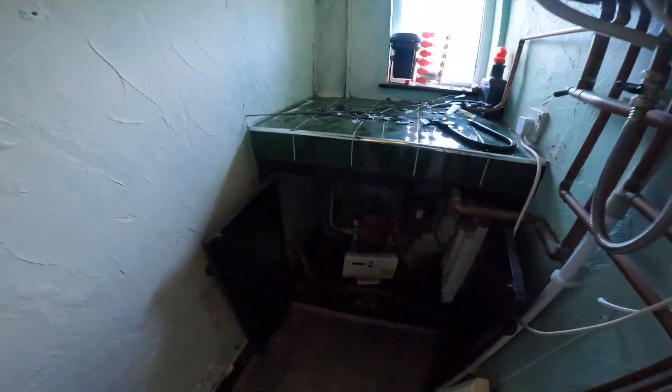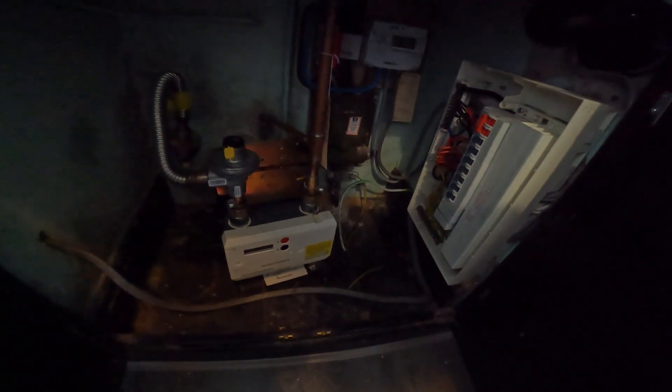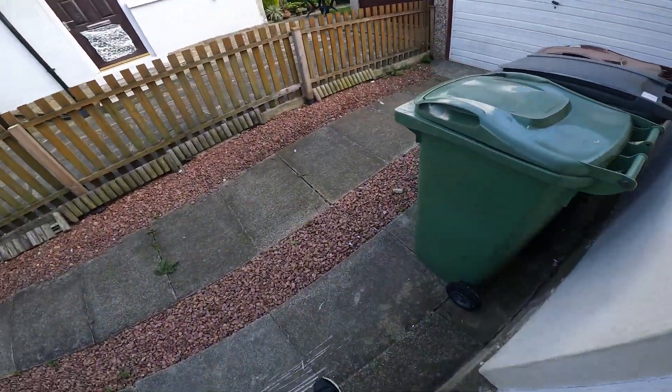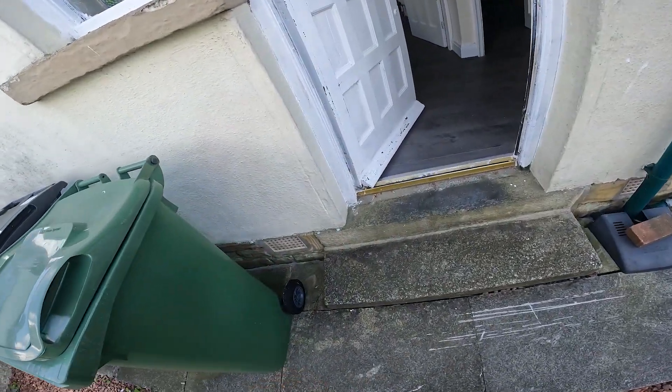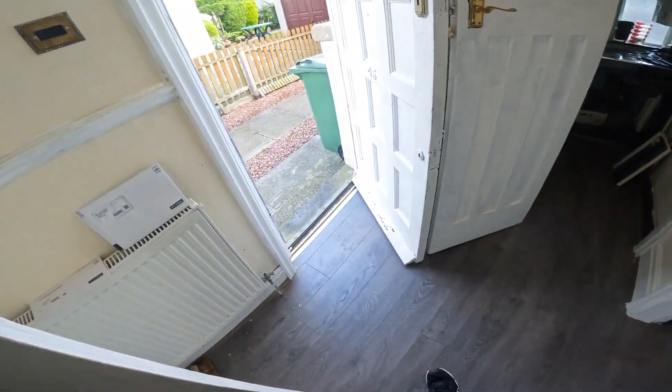Let's talk about the main earth then. That tiny little braiding - they've attached it with a tiny piece of cable. That'll need properly crimping off and lugging on, getting onto that screw down there. It needs to be a 16mm - actually it's a 16mm tail, so 10mm is fine. We need 10mm to gas - that should be nice and easy. But then we need a 10mm all the way around to water as well. It's going to have to come along through - there's a stop tap somewhere under the sink. How would you do that? Let us know in the comments below. It's literally this flooring throughout, so we can't lift it up. We're going to have to come round across the front step.